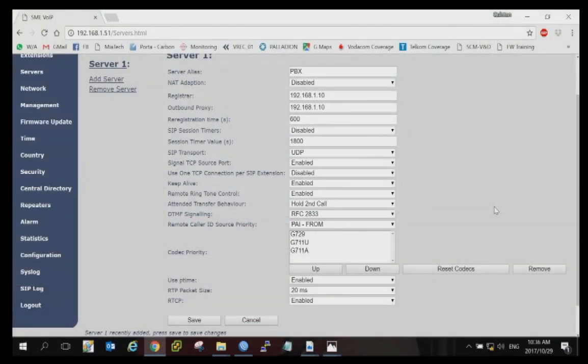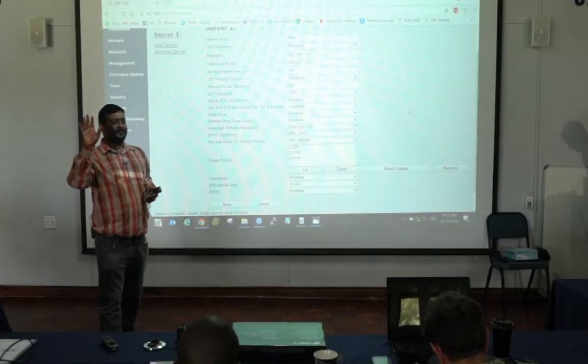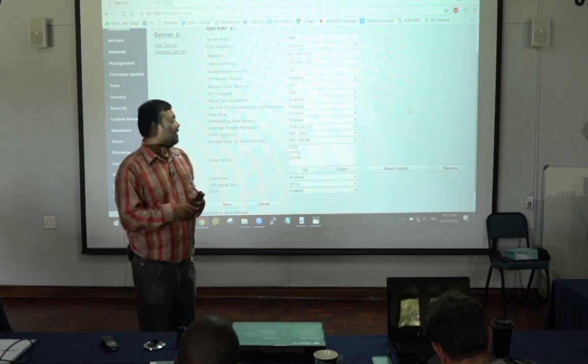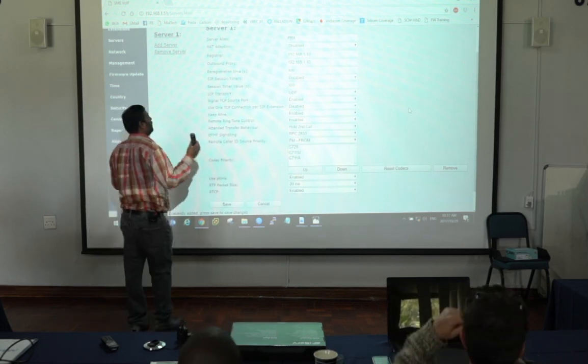Are you guys happy with everything else on that page? Yes. But you can bring down that registration time as well. Okay, so you all do understand what the registration time is? This device is going to go back to the PABX every 5 minutes and say, I'm here. I haven't gone anywhere. Don't worry. Are you still there? Right, so we're going to save that now.